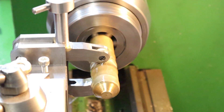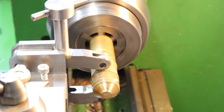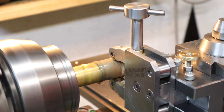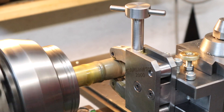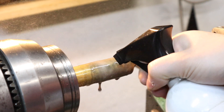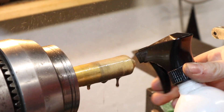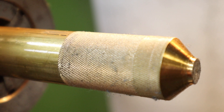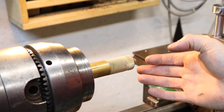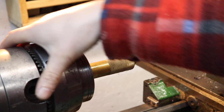Once I got to a point where I thought that was enough, I backed off the power feed and stuck it into reverse — coming back down, doing a sort of double knurling pass to hopefully make the knurls a lot more defined. First time using this knurling tool and the first set of knurls it's produced turned out really nicely.